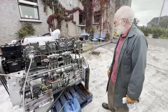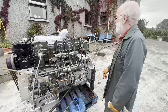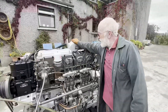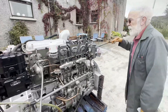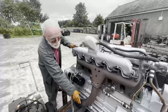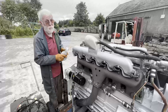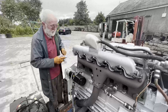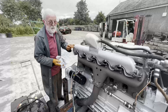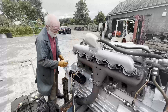What else have I got? We've got your conventional throttle of course. We've got the inlet manifold which is above the exhaust — we'll just pop around now and take a look at the exhaust as well. Centre drop, which is very common on automotive engines and quite rare on marine engines, although our own personal 5LW has a centre drop exhaust but that's of course a marinized engine, not a pure engine.